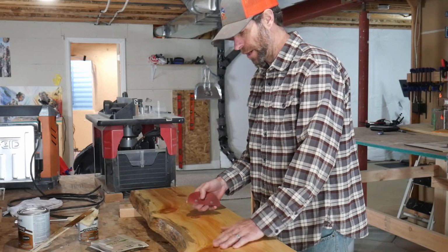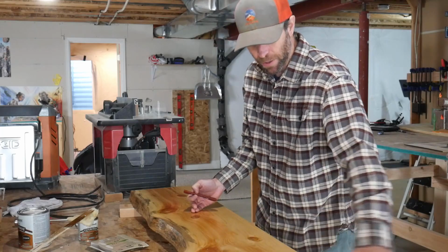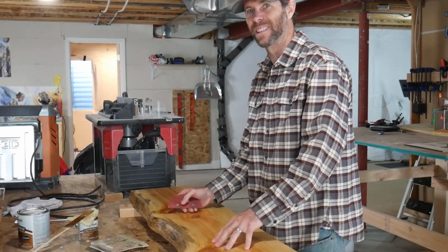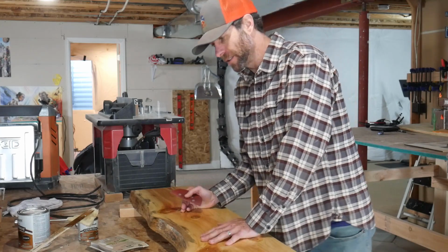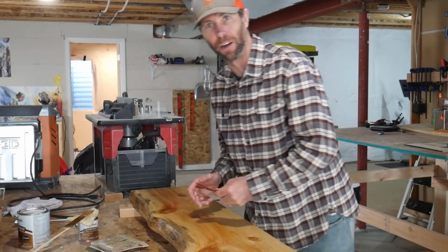Okay? So I'm going to sand this down, and then do a quick little clean with some mineral spirits, and then we're going to do another coat. We'll let that dry, probably another 12 hours, and then we're going to come back with a higher grit, probably a 600, and work our way through this process until we're about 1,000 grit on the sandpaper, and we've had at least 3 coats done on this thing. It'll look really rad when we're done. All right, let's get started.